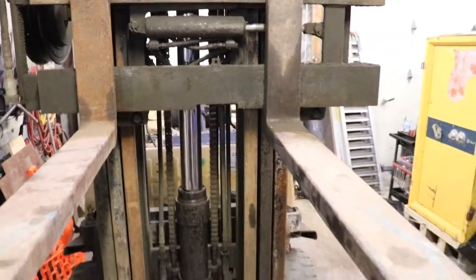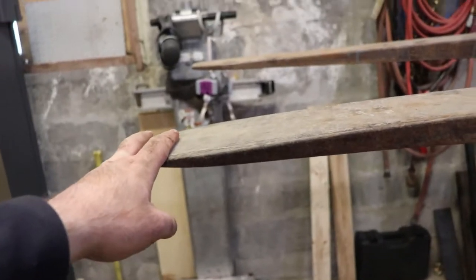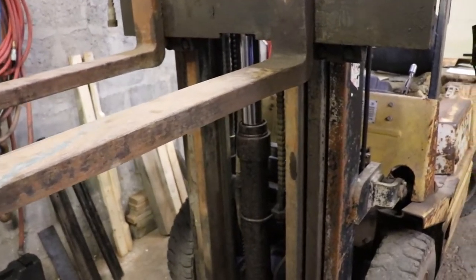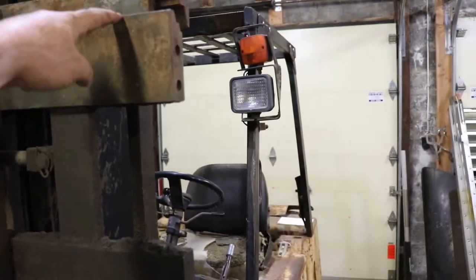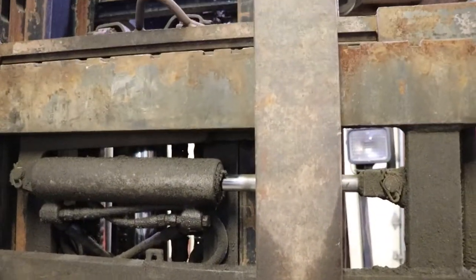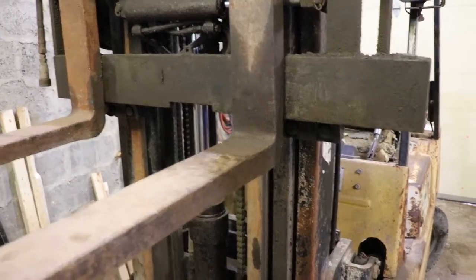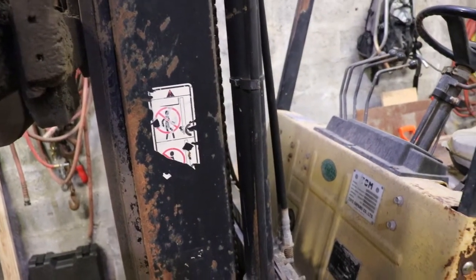I think I'll be taking the top of the mast off, which is really easy on this thing - I'll show that later in the video. These forks are junk - one of them is bent and this one closest kind of droops. The critical dimension when buying forks is the carriage height, which tells you the class of fork you need to buy. There's a little window so you can slide the fork inward and pop it off. I'm going to be taking these forks off pretty soon because they just take up a bunch of space.